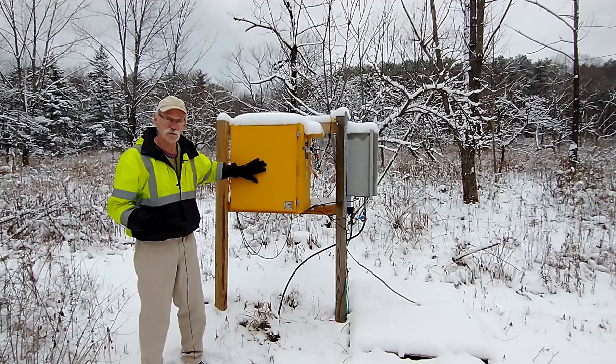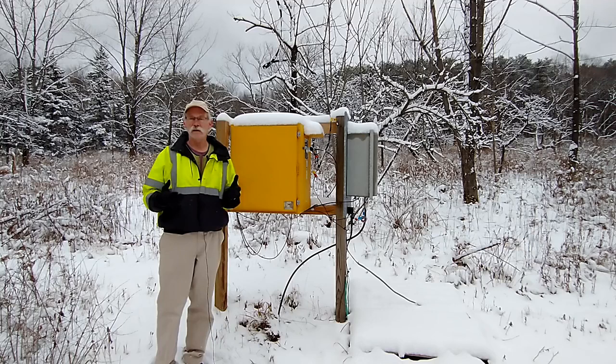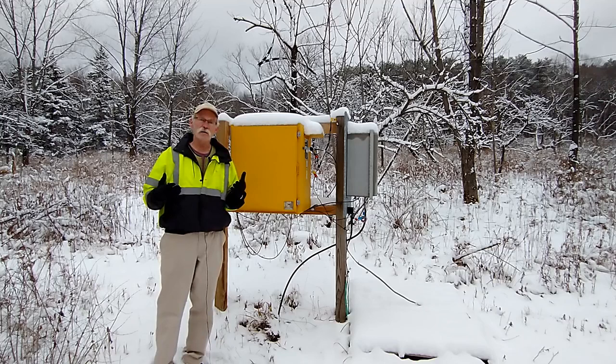It's an auto tuner. And if you're on 630 meters, one of the big issues is that, ideally, a vertical antenna, which would be the desirable antenna to use on this frequency, would be a quarter wavelength long. Well, at 630 meters, that'd be a 500-foot tall antenna. And with my resources, that's just not going to happen. So what I've done is I'm just using the feed line for my 80-meter dipole, and I'm using it in an old configuration known as a Marconi T. I'll give you a more detailed view of this later on.